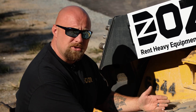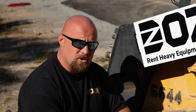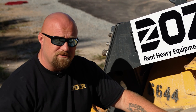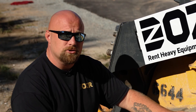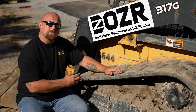If you have a wheel unit, you're looking for major divots, cuts, or abrasions on the wheel as well. The difference is it's a tired machine, so you won't have to look for sprockets because everything is internal on a wheeled unit. Also make sure all of your bolts are tight — the ones that adhere the wheels to the machine on the axle — for your drive axles.